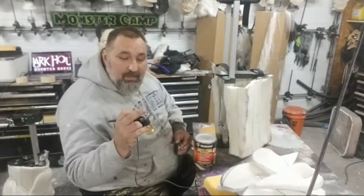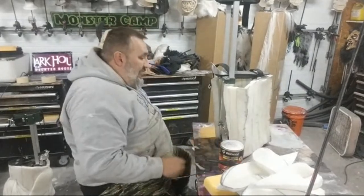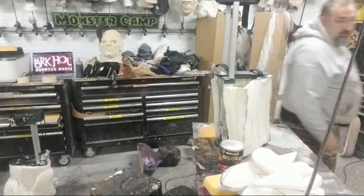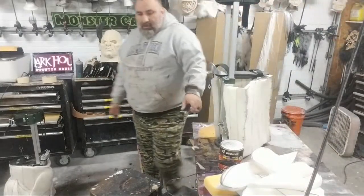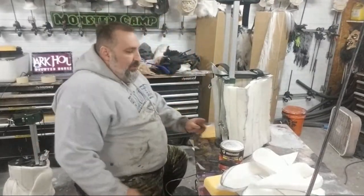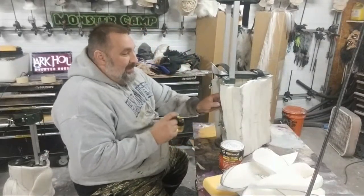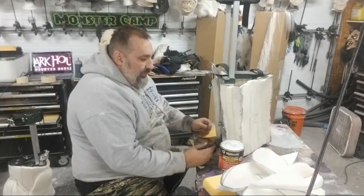What I think is happening is my compressor isn't on, so I don't have enough PSI to push that through. Turn that sucker on. That was it. When you're using a glue like an upholstery adhesive or contact cement through an airbrush, you really do want to have PSI about 90 to 100. A little airbrush compressor just won't do it.